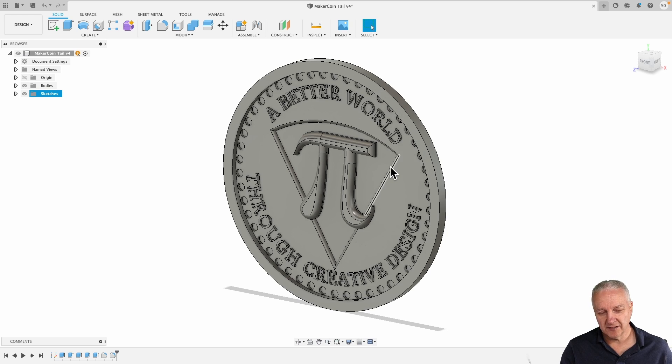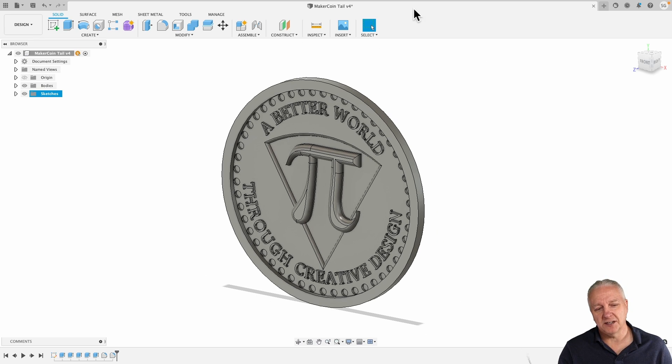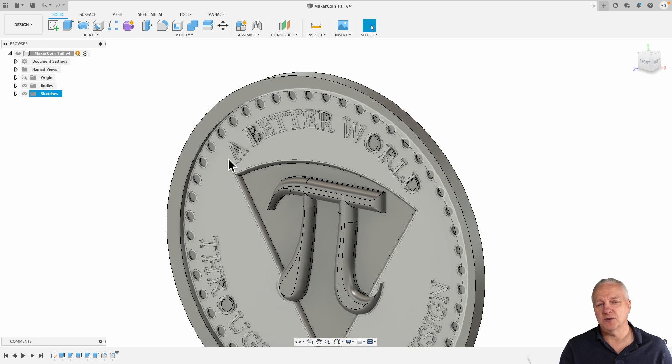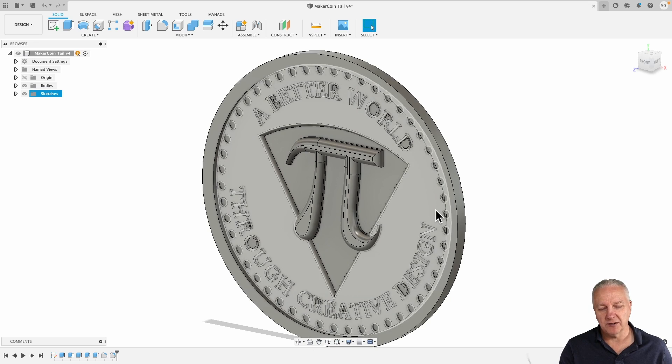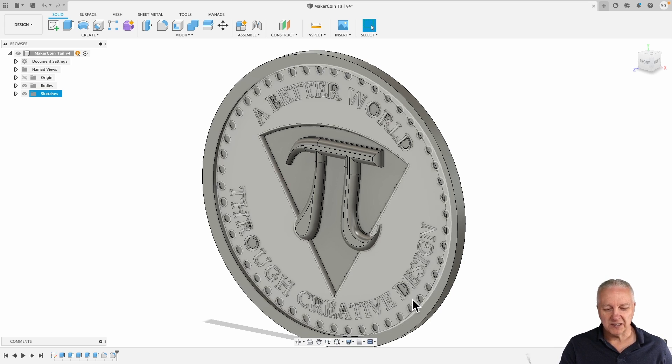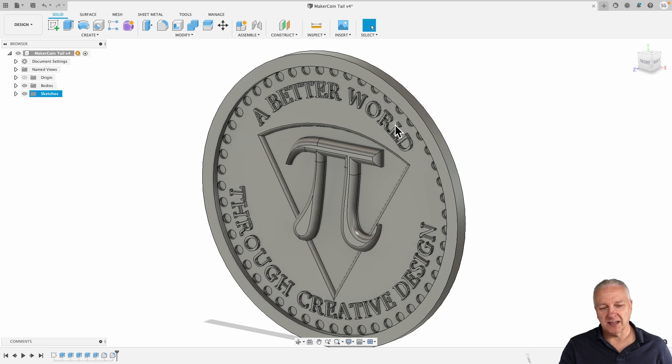I hopped into Fusion 360, which is where I designed the coin. The coin itself is two concentric circles and then a bunch of smaller circles around the outside. I took advantage of Fusion 360's pattern tool to create one circle and then wrap it around the entire perimeter of the coin. Then I took some text and wrapped that around a construction line circle. I dropped my logo in the center and then got to the extrusion piece. My text here is extruded outward with a 1/32nd inch ball bit, which is what I'm going to use. It's a little hard to get the kind of detail I want, but it works. Honestly, if you look at any coin, text on it is raised, not engraved. If you took a V-bit and engraved this you'd get a much better result, but I wanted to do a more traditional coin. I should actually get a 15-degree V-bit — I didn't have one, which is why I settled with the ball bit.